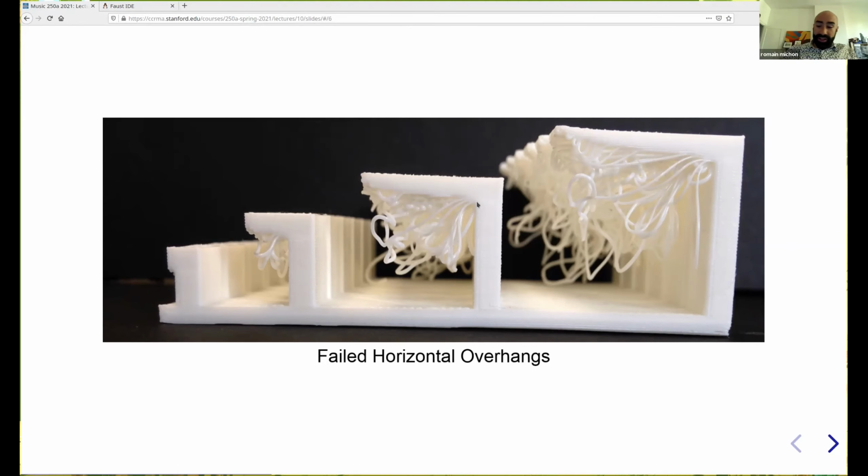But basically, say for example, you'd like to print this object, and this object that I have here is just the cap of my water bottle. Okay. So there is a gap at the middle, right? And you can easily print this object if you print it in this orientation. So the cover here is actually going to be the first thing which is going to be printed, and then you're going to add more material to print the rest of the object.